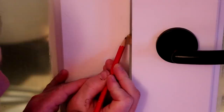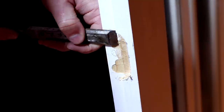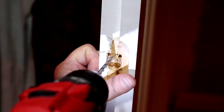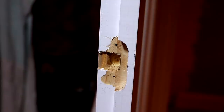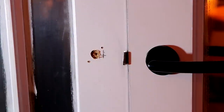For the other half of the rebated latch I decided to fit it with the door in place as it looked relatively straightforward. I lined it up with the centre mark and marked around it, then made a few passes with a straight bit in the router to get a flat mounting point. A bit of clean up with a chisel, then I marked up the area to receive the latch, which I did with a few different drill bits and some chiseling. I also needed to remove a bit of material for the latch plate — not a perfectly neat job but a little bit of paint and it'll be fine. Then I fitted the other handle which is more for aesthetics than being functional.